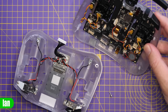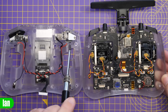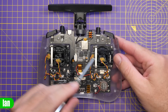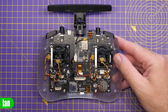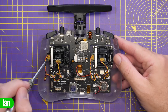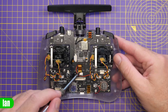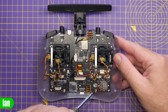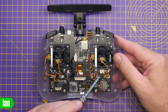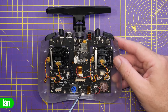That frees up the back cover from the main shell. On the back we have the module PCB, the momentary push button, and the S1 rotary encoder. Looking inside, it is a single PCB board with the ExpressLRS module mounted on top. All switches and buttons are directly mounted to the PCB. The gimbals are Hall Effect and their wires run down to each side. We've also got wiring to the ExpressLRS module, the LCD display wire in the centre, the speaker wire, and an unused connector labelled 'power key' — not sure what that's specifically for.